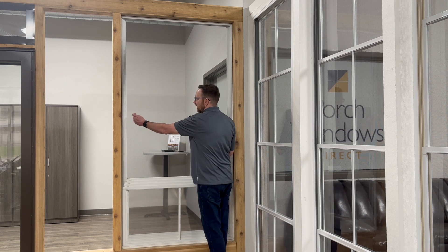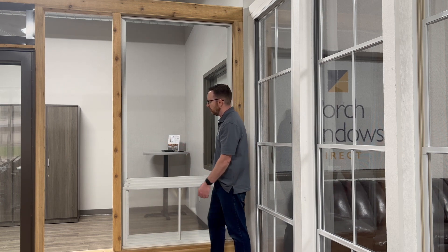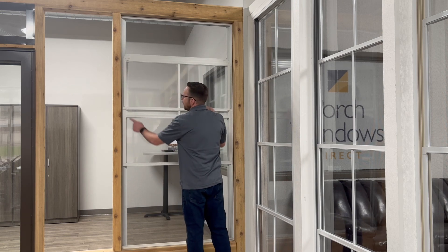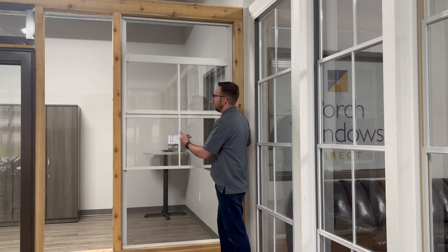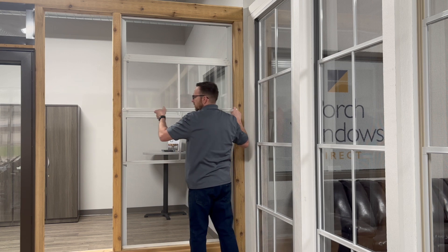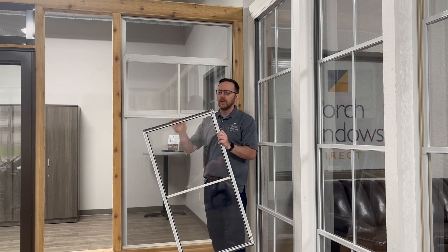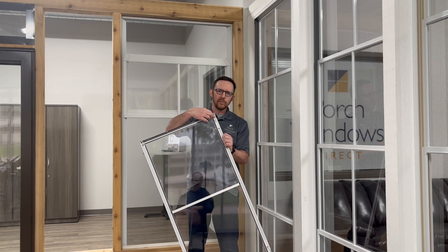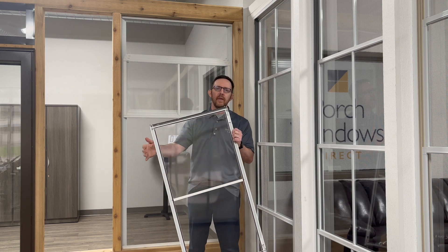This aluminum track actually cascades in, and that creates the need for the different size panels. That track does come into the opening a little bit, reducing the screen size. To take the panels out, these push-button pins are what you push in to allow the panel to come out. You unlock it, tip the panel in, and then give it a little rotation to come out. On the back of the panel you can see the pin and spring assembly — those springs are what you compress to allow that panel to come out.